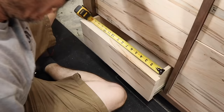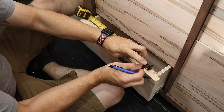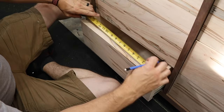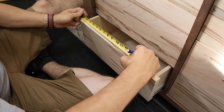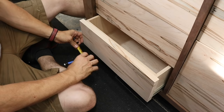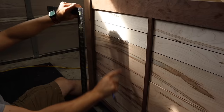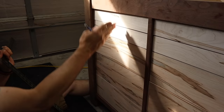Because I used three-quarter inch material and a seven-eighth inch drawer face, I used a Forstner bit to hollow out the hole so the drawer pull screw would be long enough to reach. Use a screwdriver to tighten your drawer pull screws so you don't strip them out, and don't forget to clean up your marks. An even more accurate way: just measure center to center of the pull holes — on mine, that's three and three-quarters of an inch. Measure over that distance from each corner, make a mark, and connect them diagonally just like before. It's a little easier than holding the pull up there. For multiple drawers, just find the center on the top and bottom and use a straight edge to make sure all your drawer slides line up exactly.